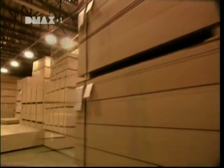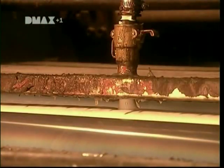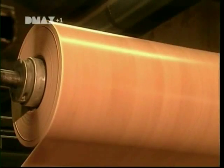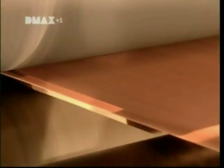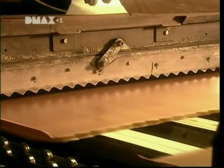At the furniture factory, the first step is to laminate the panels with a decorative covering. First, a spreader covers the board surface with glue. Then another machine sticks on a one and a half meter strip of decorative paper fortified with resin, varnish, and other chemicals. This covering comes in many different colors and designs, from solids to imitation granite or wood.